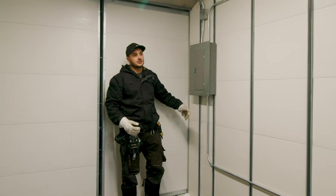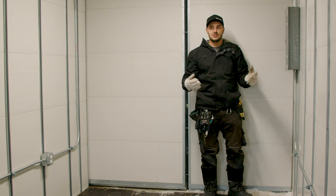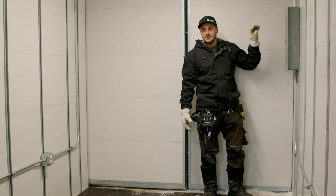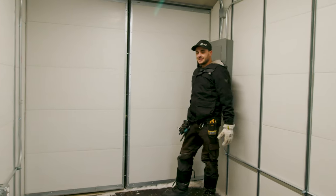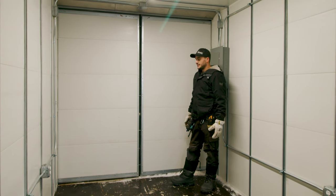It's really simple to trench power to this thing — come up and right into that junction box. When customers get this container, all they have to do is hook up the wires to the lugs outside and the lights are on. That really tidies up the electrical, makes it modular, and lets you add breakers and circuits afterwards.